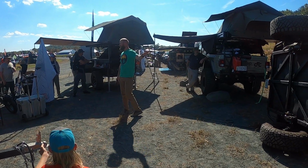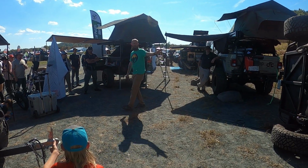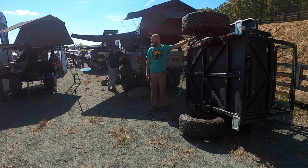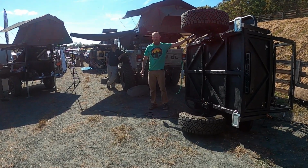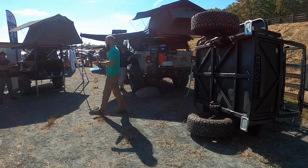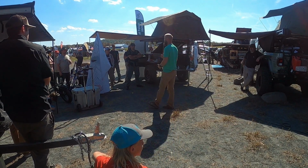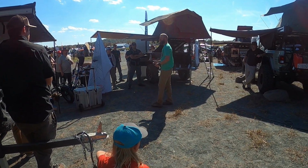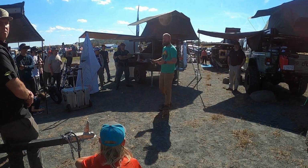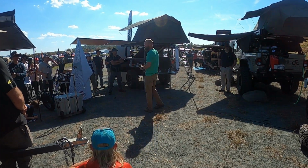If we are clear as we keep getting closer, it's a good idea maybe to carry a fire extinguisher as you're coming up. But as we're getting closer, just put a hand on the trailer, right? Give it a little shake, make sure that it's going to stay. If you have any concerns that while you're rigging around this trailer that it could shift, tie it, right? We've got recovery gear, let's use it. We can even use our winch to hold it in place as we're doing our rigging, but we want to get that secured as soon as possible, okay?